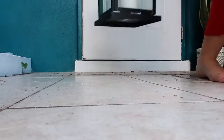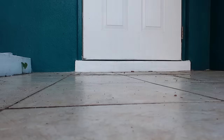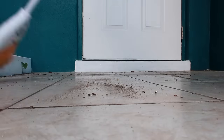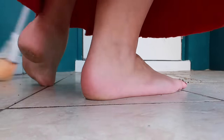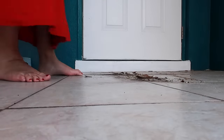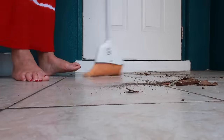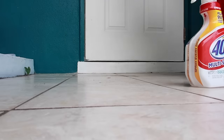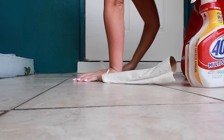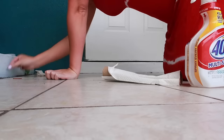I'm clearing everything off the patio - you want to start with a clean slate, so I'm sweeping and cleaning it with some tile cleaner. I'll use this cleaning montage to explain that I actually did mess up at first. A lot of people assume I know exactly what I'm doing and I don't - I just do trial and error. I used exterior paint on the tile first and it scraped right off with a fingernail. What you want is a good adhesion primer - do not use latex paint or regular Kilz primer, because you need strong adhesion for ceramic tile.